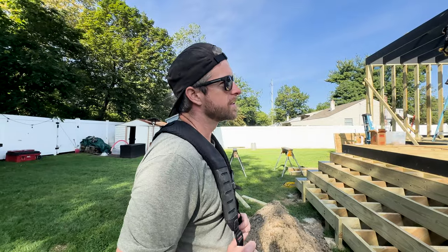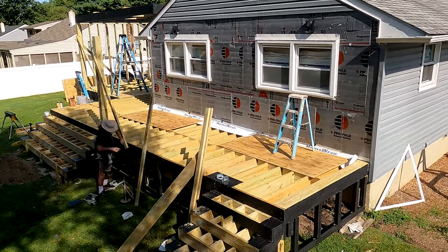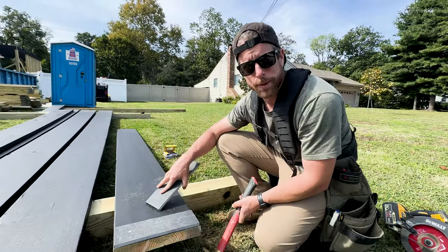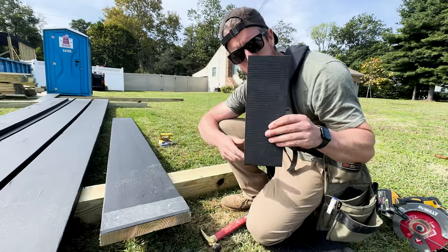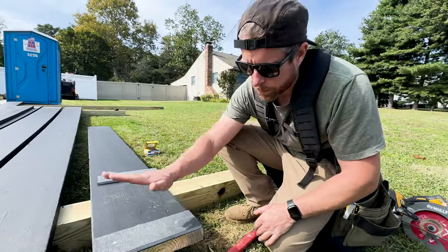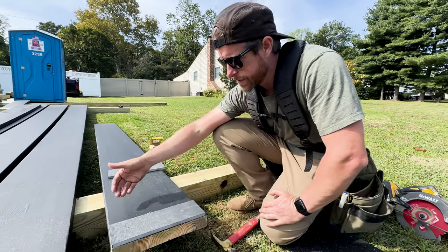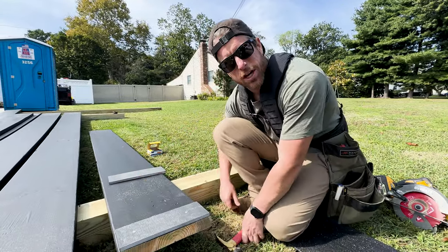GRKs per hanger. This thing's locked in for sure. I've got our beam pieces cut down to size, and because we're building it out to 5.5 inches, we're putting pieces of dark slate fascia in between, spacing them out nice and even. Then we'll have another ply on both sides and screw it all together to make it one unit. I think it's gonna look really nice, and it adds the benefit of having a little space between the boards, which water can just drain through.